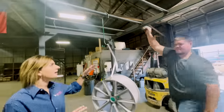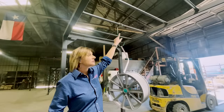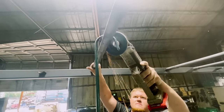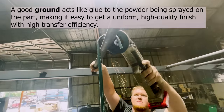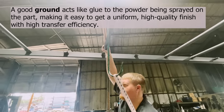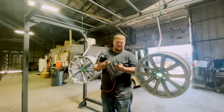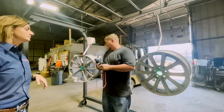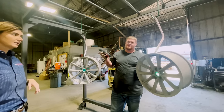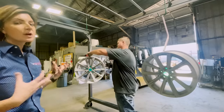The hooks have been cleaned as well so you've got good contact and can follow the charge all the way from the cart to the thing that's getting coated. Without a good charge or a good ground you're not going to get a good stick, and the powder won't look good. We make sure they're actually grounded and touching bare metal. This is called an ohms meter — it just lets you know that you've got a good ground.